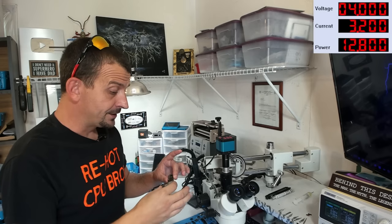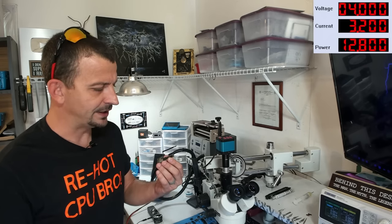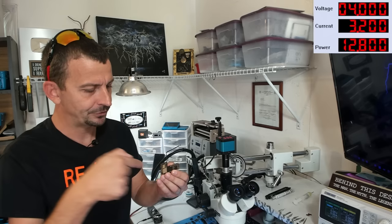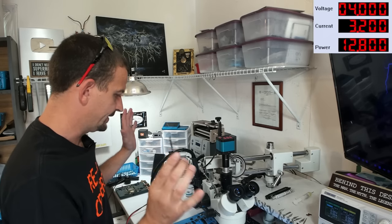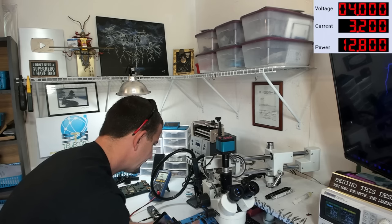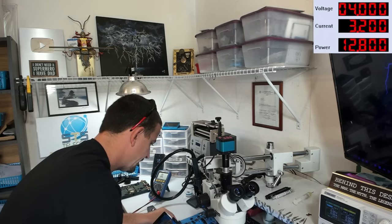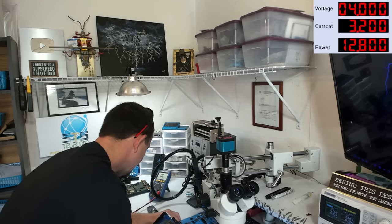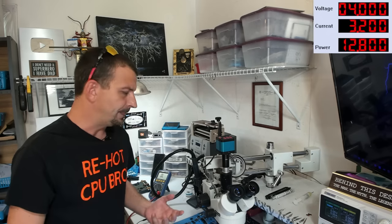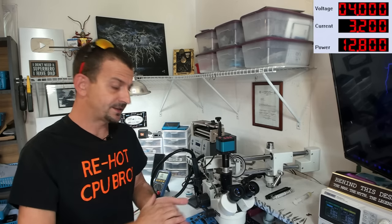So I have all of the stickers removed. I've made somewhat of a brief evaluation to be able to tell that somebody has punctured holes in this. It's time to get this board taken apart. So starting with the iPhone 12, Apple has changed the alloy that is used to join the board layers together, with the exception, I think, of the iPhone 12 mini. But anyways, this board here, it has a much higher melting point than the sandwich boards before this.